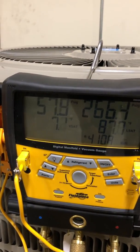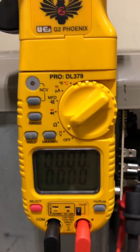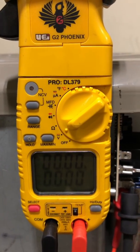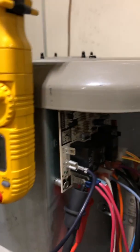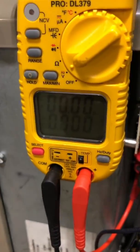The pressure is dropping nicely. Coming over here — we have zero volts across my defrost switch. That means the switch is closed. I have now verified that the switch will close on its own. Now for the second part — the timer. To bypass the timer, I'm just going to jump those two test terminals to speed up the clock and initiate defrost. As soon as I do, I'm going to plug my fan back in because I also want to verify that the fan stays off during defrost. Switch is closed — zero volts — let's give it a try.